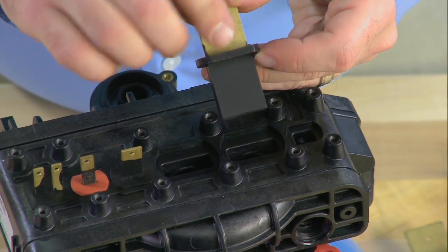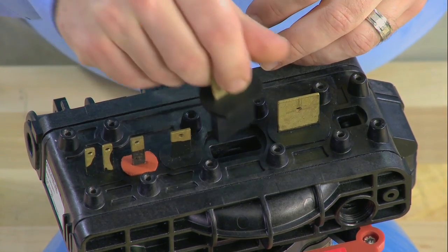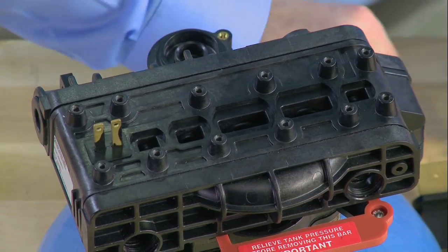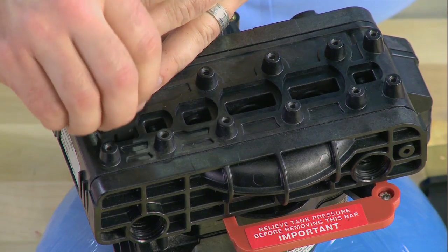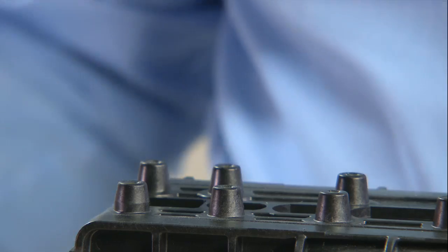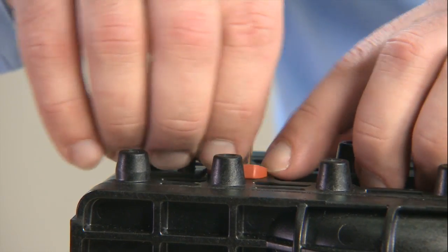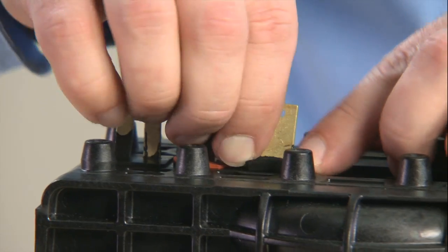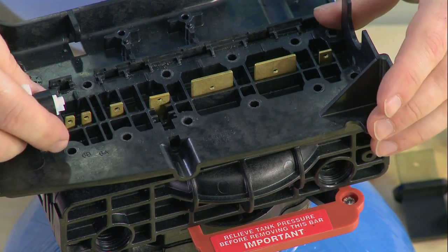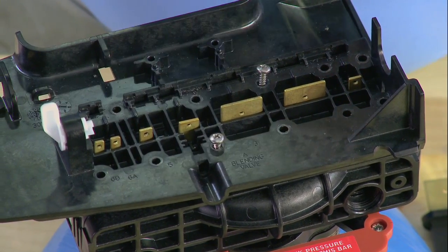In an emergency, individual sided units can be reversed for position or for which face is facing the seal. If you have a two piece unit such as this in the rear, it cannot be reversed because it will not fit into the ports. As we reinstall the valve discs, we want to make sure that we tuck them into the body. Lubricant is not required. Once they are all tucked in, we can reinstall our top plate assembly. We reinstall the screws and tension them in a criss-cross pattern.